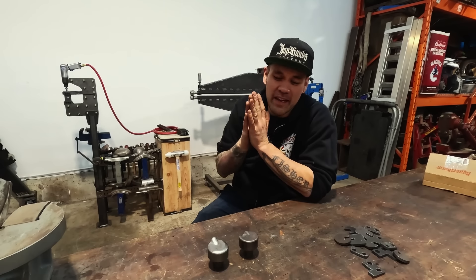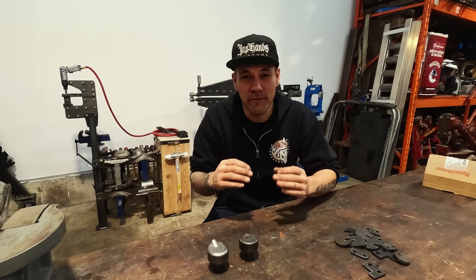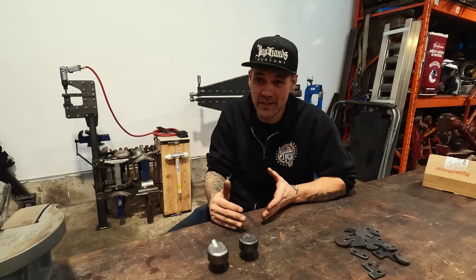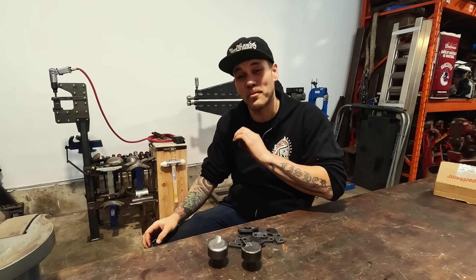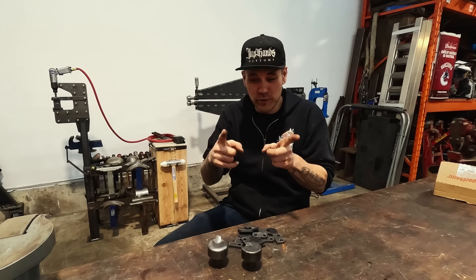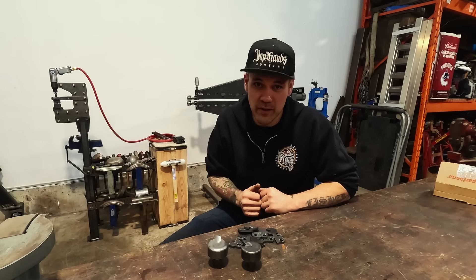That machine right there is one that we came up with a few videos ago and I'm really excited about it because it has the potential to do a lot of different processes in metal shaping — I think it's one of the most compact machines with a lot of capability. I've only shown so far how it does beads in curves and straights and profiles. If we can get that machine to do thumbnail shrinking as a power hammer, the only limitation is its size — and if you can shrink that far into a panel, that's actually quite far. You could make a motorcycle gas tank on something with that short of a deep throat.